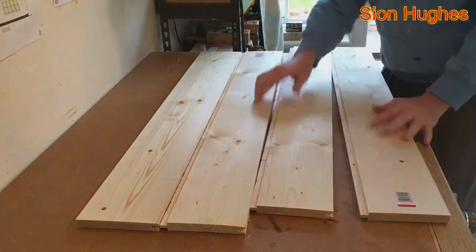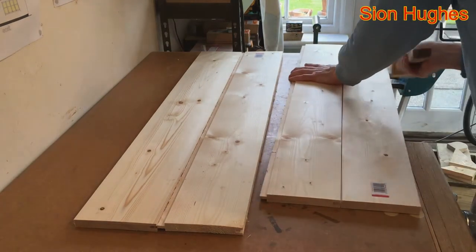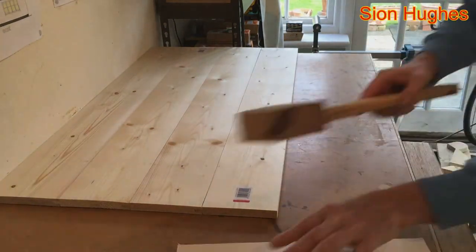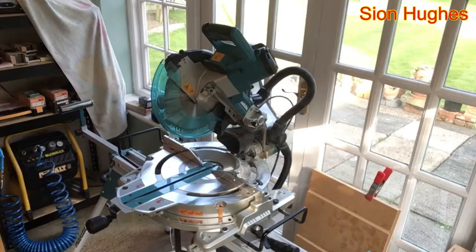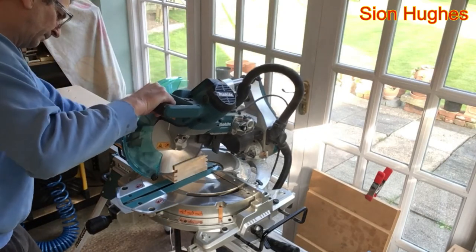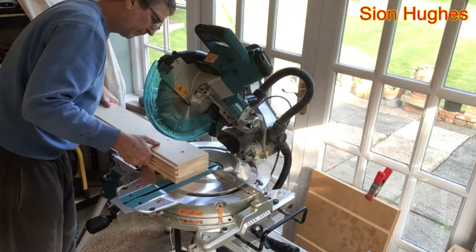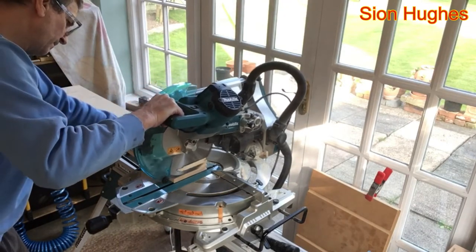Then a nice dry fit. Thinking about it - in the days before plywood existed, if someone wanted to make a wide panel this would be the only real way you could do it. It's very strong. Once I put this together I'm just dropping it around and bashing it and it feels really solid. Then I dismantle it and stack the planks together so I can give them one final cut to make sure they are absolutely identical in length. I'm not too fussed about the exact length - I don't mind shaving off a quarter of an inch or whatever.